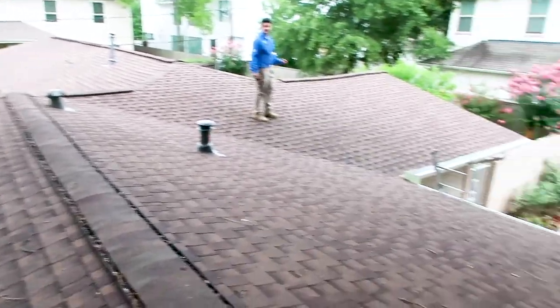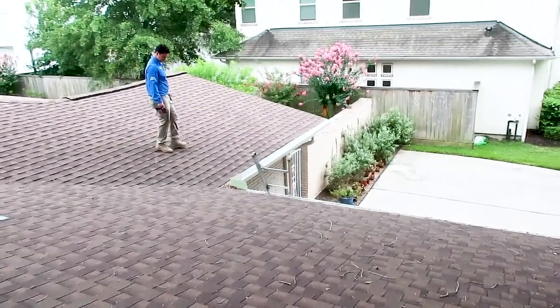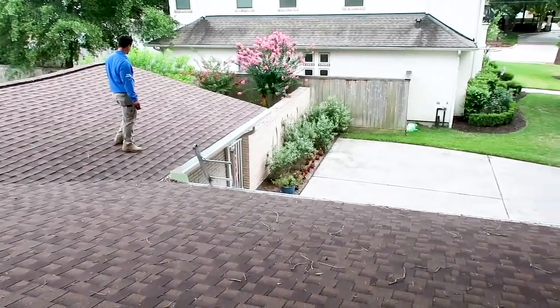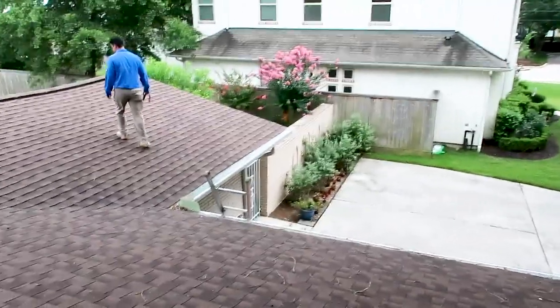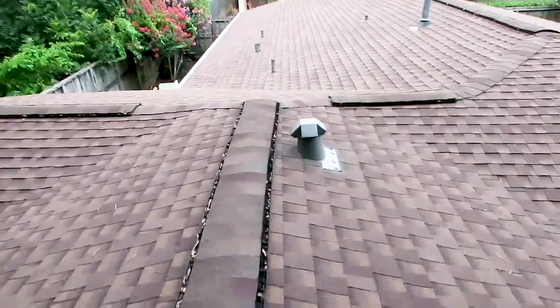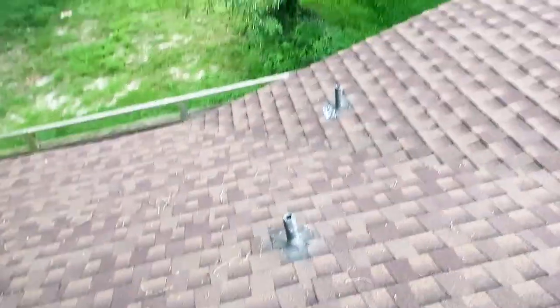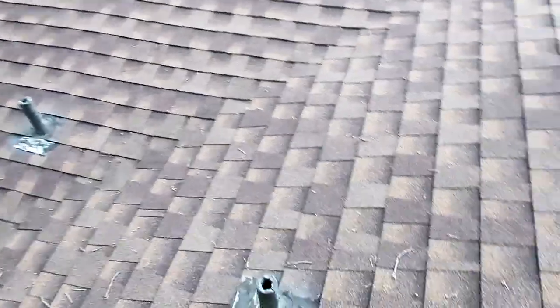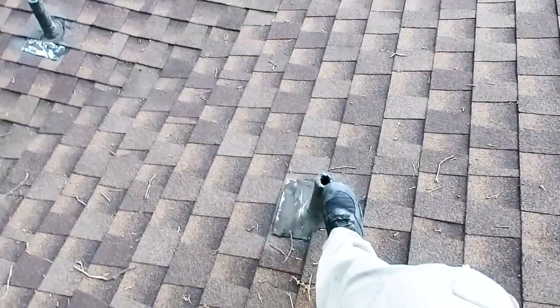Alright, we got a newer roof — it's looking pretty good. We noticed there's a little bit of pitting over in this location where Tyler's about to walk. I stepped on it, it was solid. You always want to pay attention to the penetration points. These are not very pretty — it looks like they have some sort of tar around them. We'll report this: there's old flashing with a new roof.